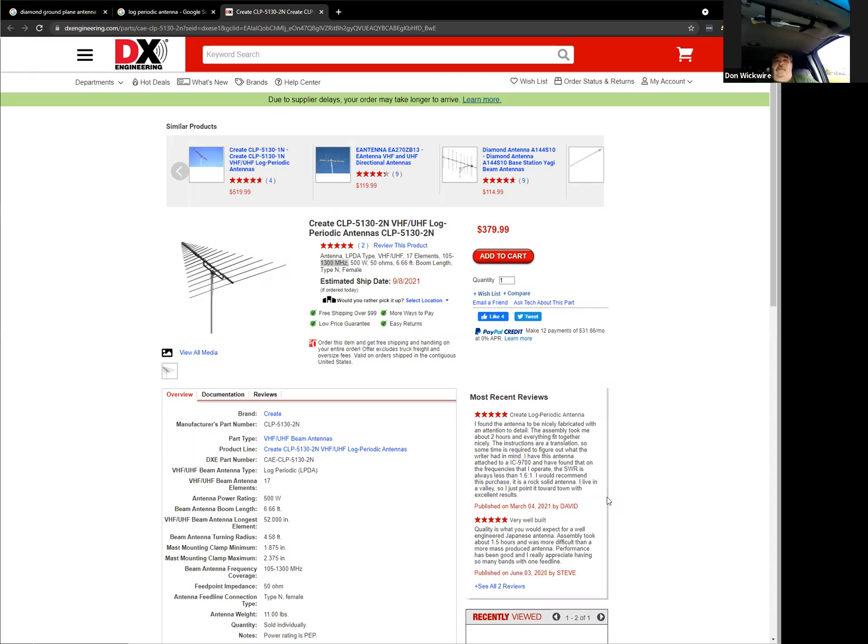The reason I asked, when I was in the service in the 70s, that's what we used for transmitting and receiving for 2 to 30 megahertz. So they were huge antennas. They were portable. Yeah, so there are quite a few. And this one, obviously, yes, you can transmit on it because it's rated for 500 watts. Ours, we were transmitting 1500 or 15K. CW.